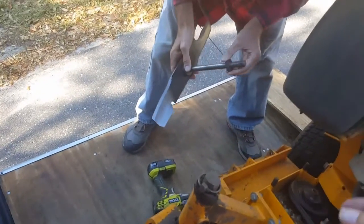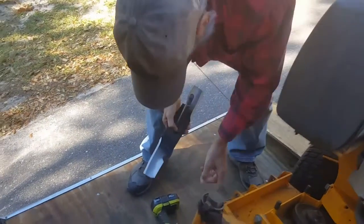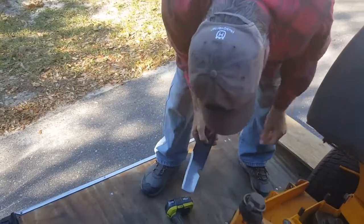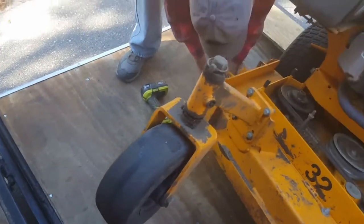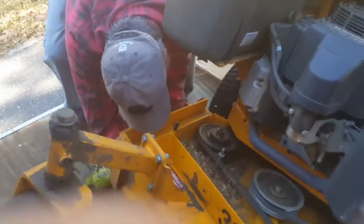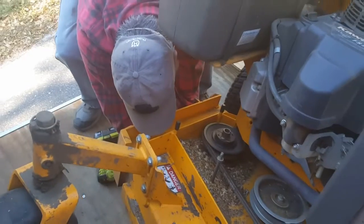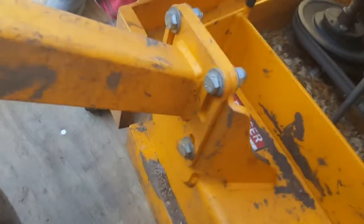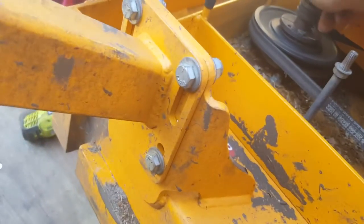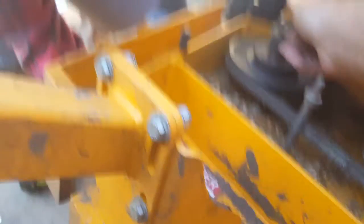Ken's gonna take one off and we just move this deck up — or the blade — a quarter inch. What you want to do is take all those fittings off and take the blade off. This is how we adjust the cutting height. We'll try to leave the deck the same so it'll go over the sprinkler heads, because if you adjust by moving the forks, you might hit a sprinkler head. So we just move it by the blades.